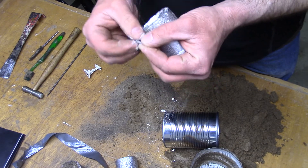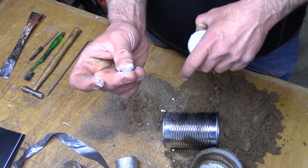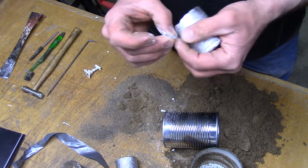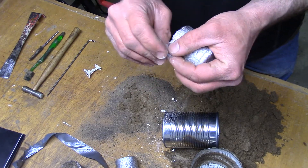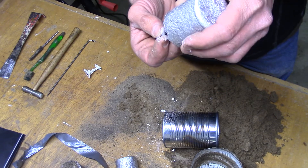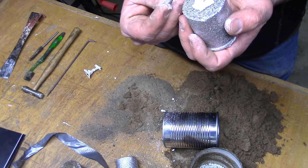The first time I tried the pieces horizontal with sprues coming in from each side but it didn't flow. I was trying gravity feed, and there was wax down here to make a small cavity for the overflow, but that didn't work.